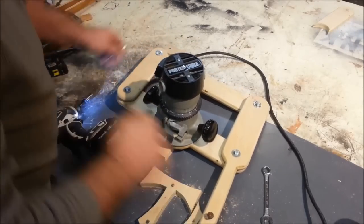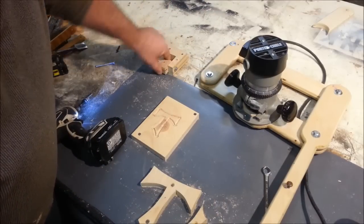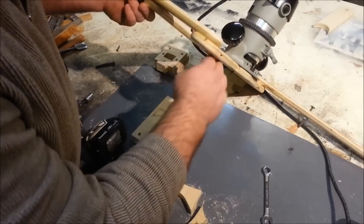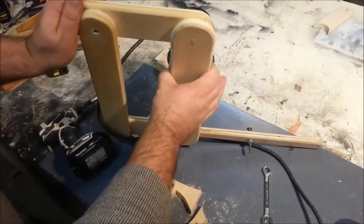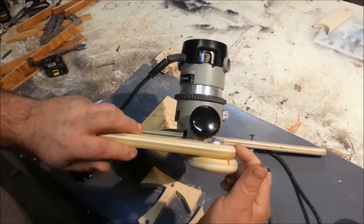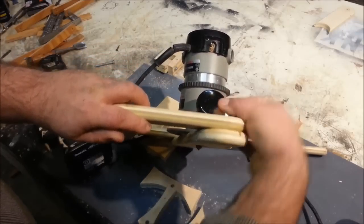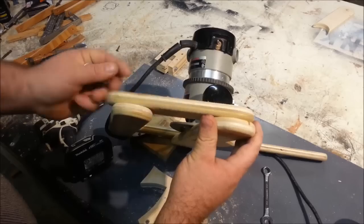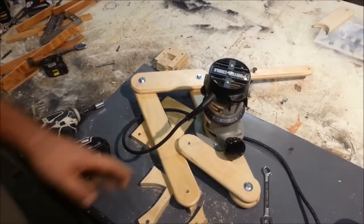I have this pinned over here — let me show you how. I have a block of wood with a quarter-inch hole drilled in it that I thread a 5/16 bolt into, and it sits on a pivot point so I can move this up and down and get my bit out of the way when I need to. On the sides, because I don't have a lot of room under here and wanted to keep it close to the table, the bolts don't come all the way through. I have a quarter-inch hole drilled in the bottom piece of plywood and a 5/16 hole drilled in the top piece, then I thread a 5/16 bolt into that quarter-inch hole. Once I have it set up where I want it, I'll back the bolt out a little bit, drop a little CA glue in there, then tighten it back down — making sure not to get it too tight so it moves freely — and that'll keep the bolt securely in place.